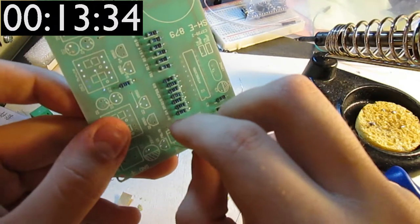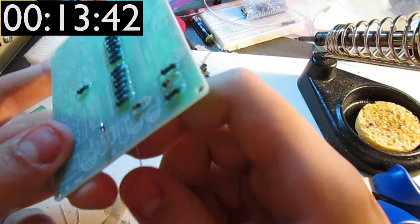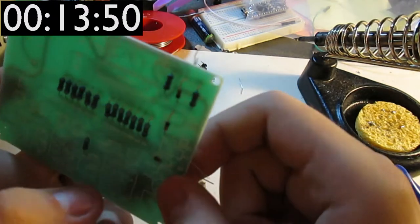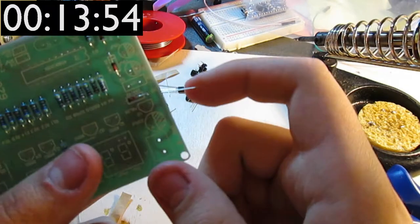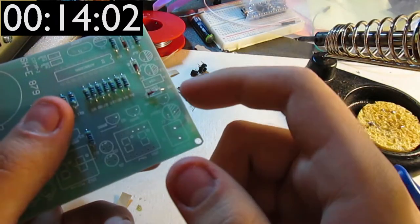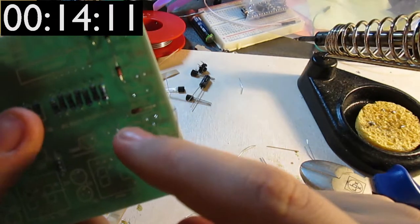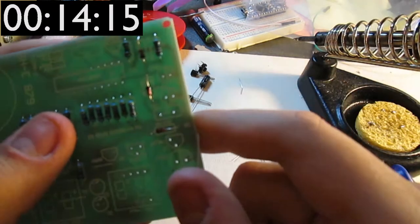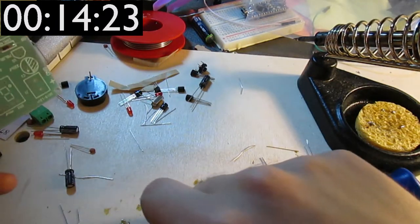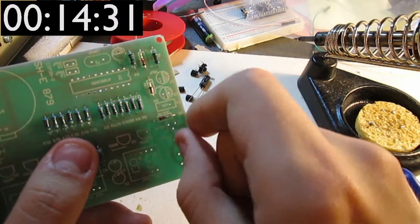Point out at this point that diodes are polarized components, as opposed to resistors. You have to mind the way you put them in, because if you don't know what a diode is, it's essentially a component that lets current flow in only one direction, and it means that the conventional current, which goes from positive to negative, will go through in the direction marked by the black band or the line on the silkscreen on the PCB. In actuality, the actual electron current is going the other way, and you have to blame the original creators of the circuit diagram specifications for that.